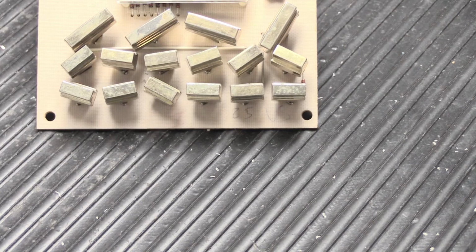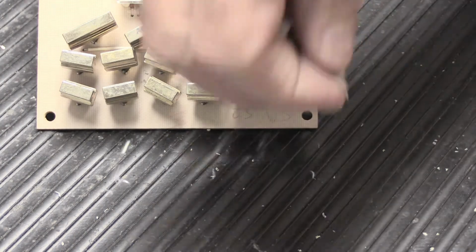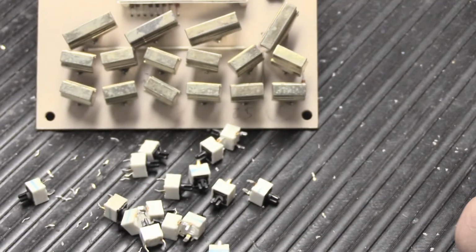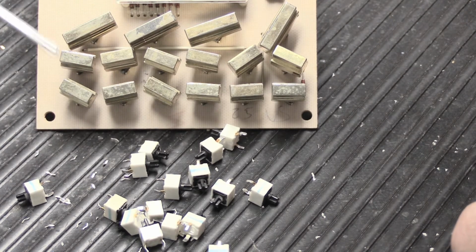I'm back. So as you can see, all of the gold button caps are now askew on their switches because they all rotate because all the switches have been replaced. And here are all the original switches, not that one, that was a sample. Anyway, here are all the white switches. And actually, if you look a little carefully, all these little shiny pieces of metal that I just threw on the workbench, those are all the little legs that I snipped off the new switches to reduce the count of legs from 4 to 2. So now they all fit, and they're all soldered on the board.